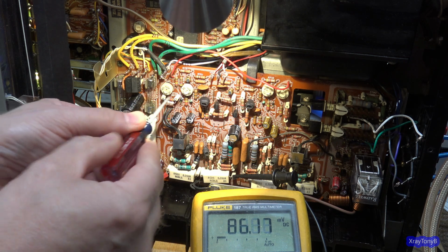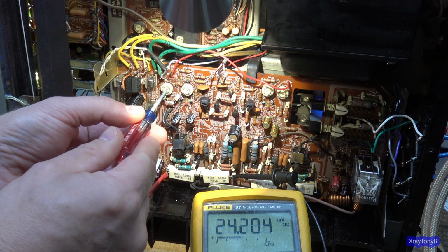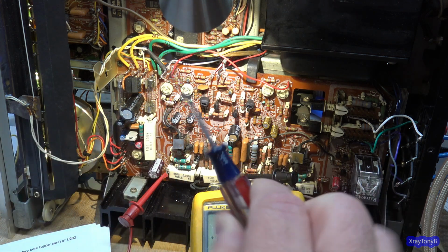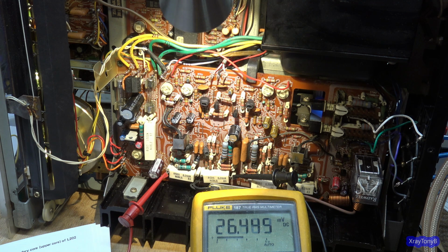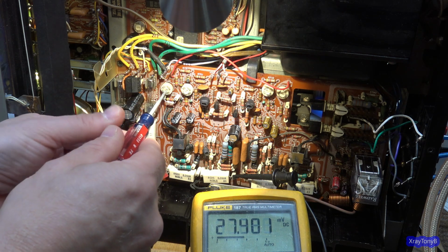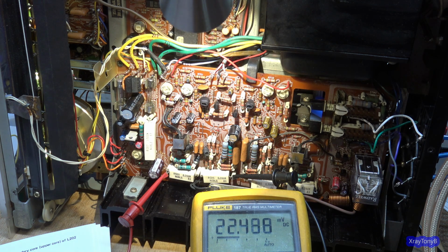Oh yeah. See what that did? It's way up. See, and here's the problem with this method. You see how touchy that pot becomes? The more latitude that pot has, the more rapidly it will adjust across its range. So the pot had a nice long adjustment in it. Now it is very, very touchy. So I'm not real keen with that. See, there's 24, 22, there we go.